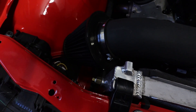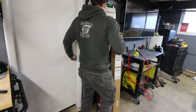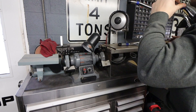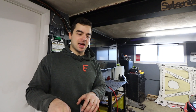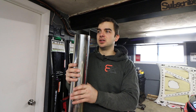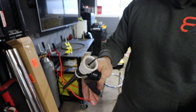The goal is to get it out through that hole and bring it down somewhere underneath. To do this I got some brand new stainless steel pipe. I also put together a new stool for the welding cart so I can sit more comfortably — the old one was too low, the new one was too high, so I'm going to cut the legs down. Then we've got to make a whole bunch of pie cuts, or I might have to just buy some. And I got a new number 12 cup, good for stainless steel, so everything should be set up to weld stainless steel.